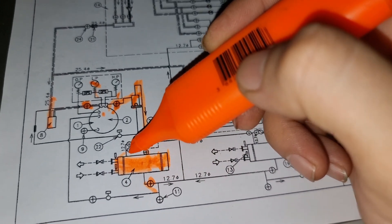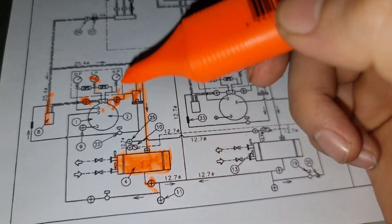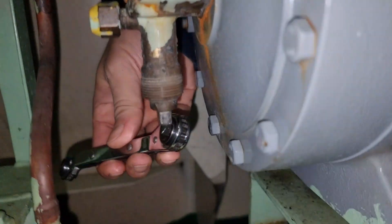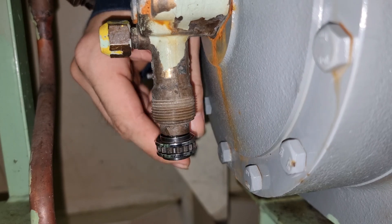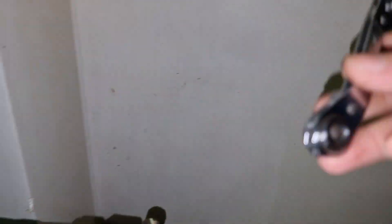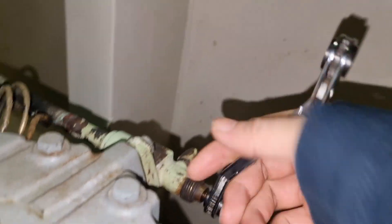In this way we can have a clear monitoring of how much refrigerant is already in our system. After doing the pump down on compressor number one, we need to check the cooling system of compressor number two. After that we will crack open the suction service valve of the compressor — it is imperative to use the proper tool in this kind of operation so that we will not damage the service valves. After that we will fully open the discharge service valve of the compressor.